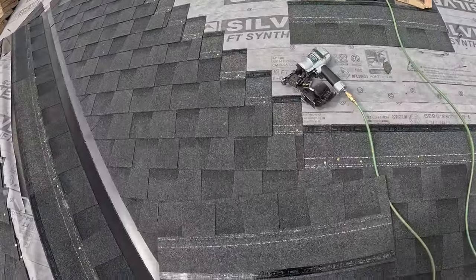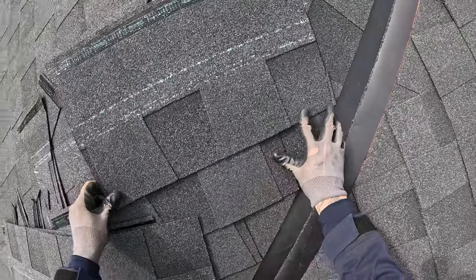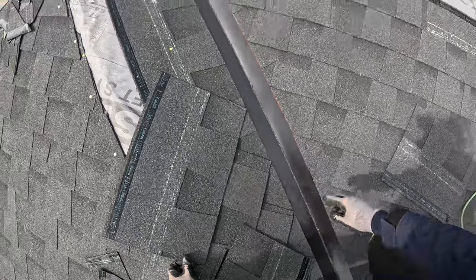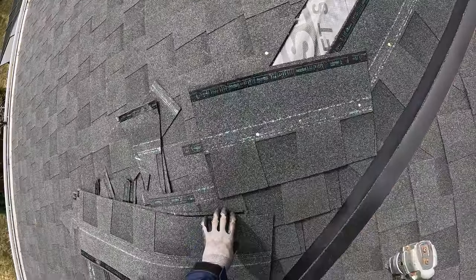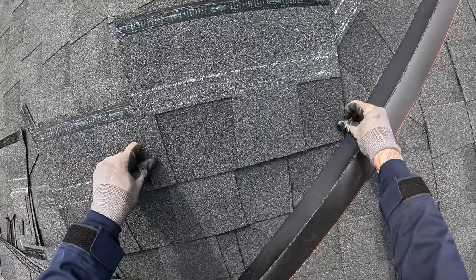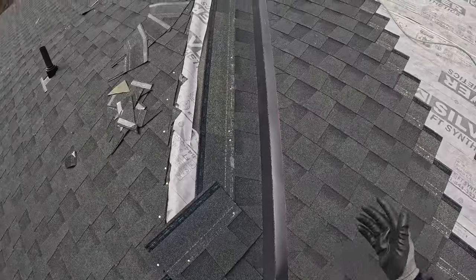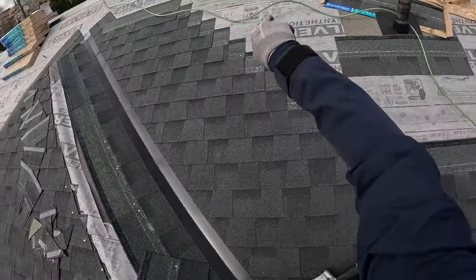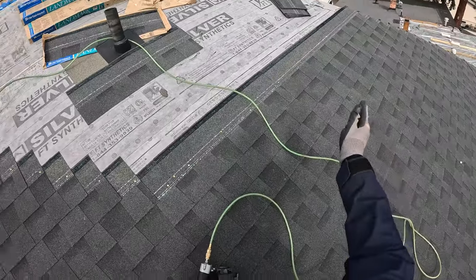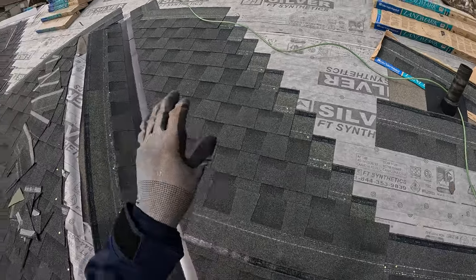These old houses aren't framed perfectly square — that's why we have chalk lines, that's why we have tape measures. If you have the ability to do these jobs really well, you need to be doing that. It's not acceptable to just slam these on, or caulk low nail holes — homeowners aren't paying you to caulk the roof, they're paying you to shingle it. Your mentality going in should always be: work the problem. A little drop row here is nothing, but if your whole front is messed up, all these rows are straight, there are no low nails anywhere — it's a big difference between having 10 feet of one shingle low versus having a whole roof completely messed up.